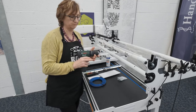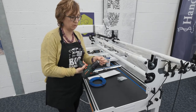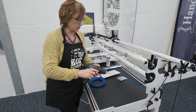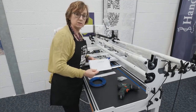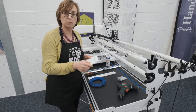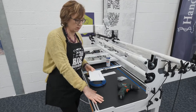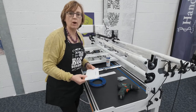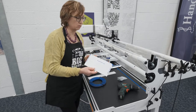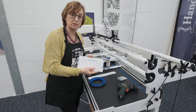You'll also need a drill. You're going to put the new drill bit into your drill and change it to the drill setting. We're going to use this template so that we can precisely work out where to put our screw holes into our table — we don't want to have to drill those twice. We used to follow the instructions in the manual, but Pete very nicely made some templates, and I've copied these so everybody who's doing a self-install is going to have one of these templates.